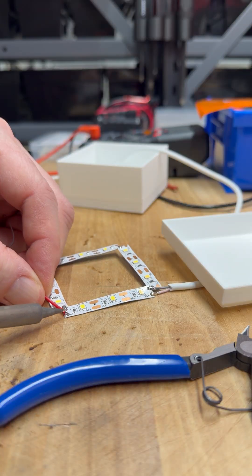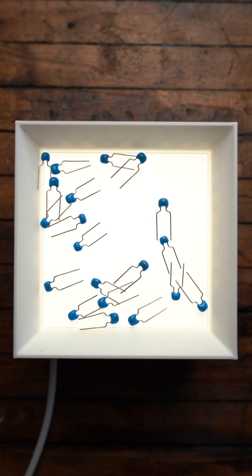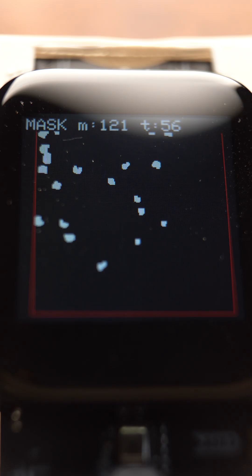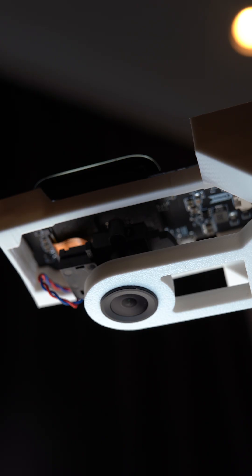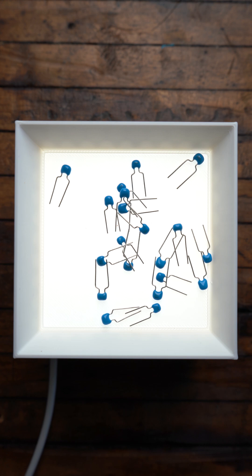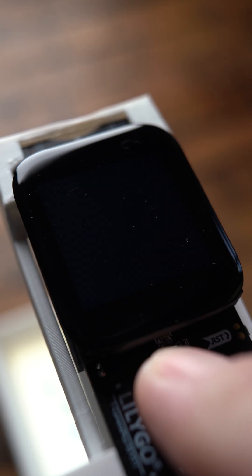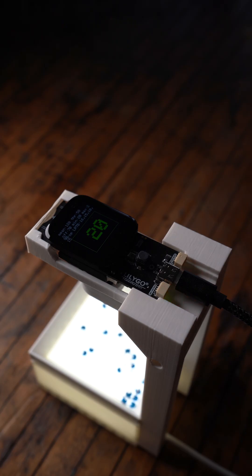So I designed and 3D printed a backlit counting tray, which gave me really nice, crisp silhouettes. I also made a camera mount so the framing stays consistent. And I added a region of interest, so the software only processes what's inside the red box. All this happens in under a thousand lines of code. Even when parts are touching or slightly overlapped, enough light still gets through to keep them separate. The button cycles between camera feed, the blob mask, and the count screen — so if something's wrong, I can see why instantly.